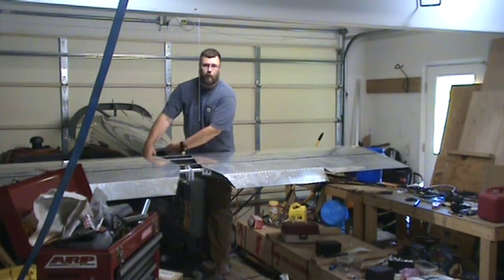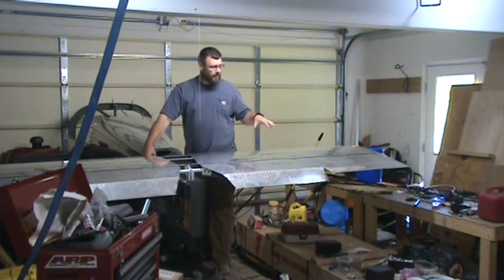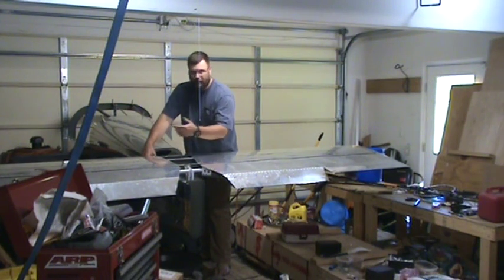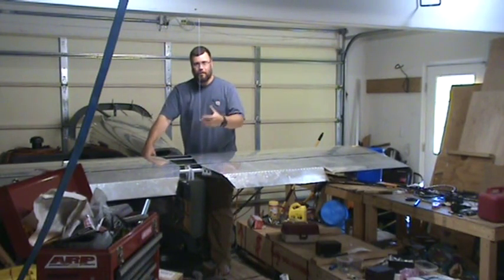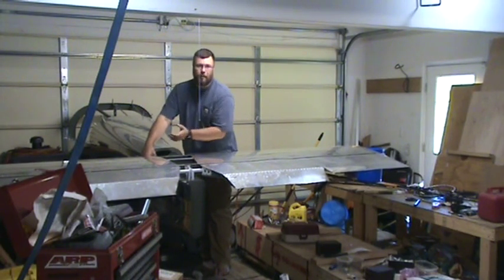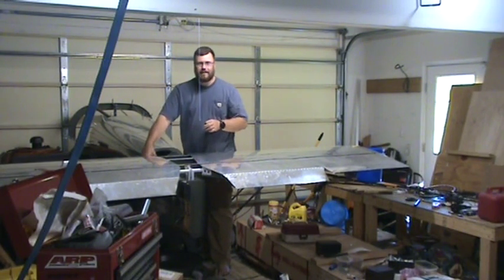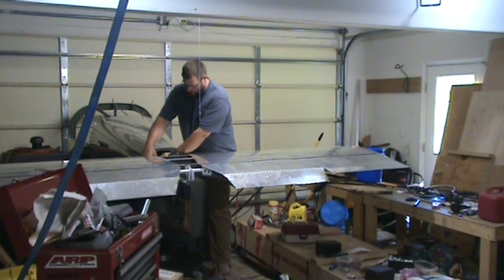And some of this required adjustment of the clevises up front. And like I said, I followed the directions exactly, getting everything in the middle. Well, this had to shift the whole cable housing forward, because actually looking at the brace, it kind of makes sense. It's a little bit further back. And part of that might be maybe I didn't get the braces in the exact correct position, but I could have sworn those holes were punched and then match drilled. But slight variation in build.